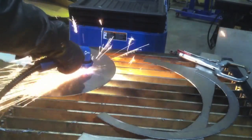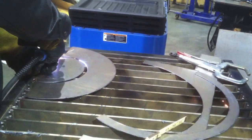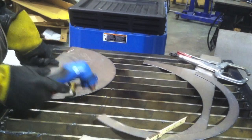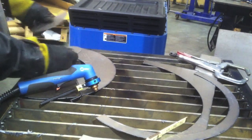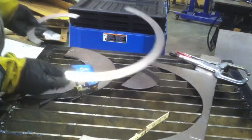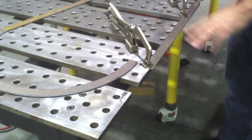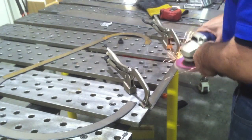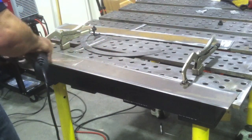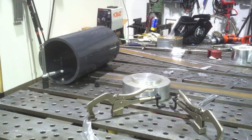Now I can use the stock Miller arm — works a whole lot better, a lot smoother, as you can see. Set it about an inch inboard, leave a little extra for the kerf, and now I've got the radii cut. Everything else is going to be straight cuts, pretty easy. Now I've got to get all the stuff cleaned up for welding, so I'm going to clamp it down to the table and get a four-and-a-half inch grinder with a flap disc and knock off all the dross. I want some nice small TIG welds — you've got to get the dross and slag off for TIG welding to be fun at all.